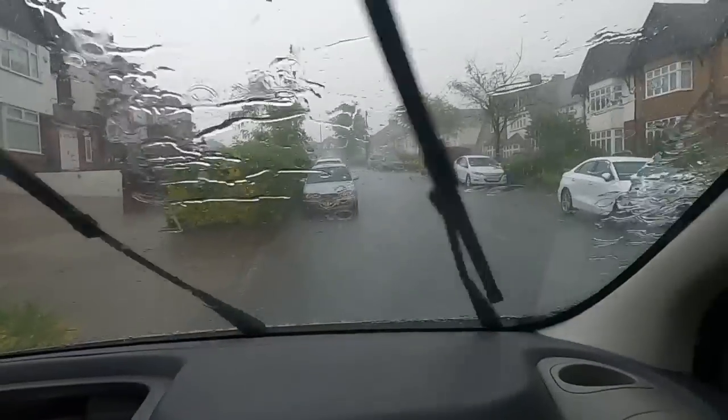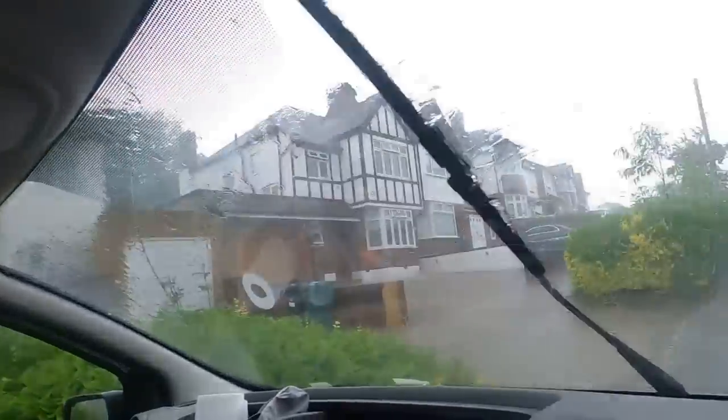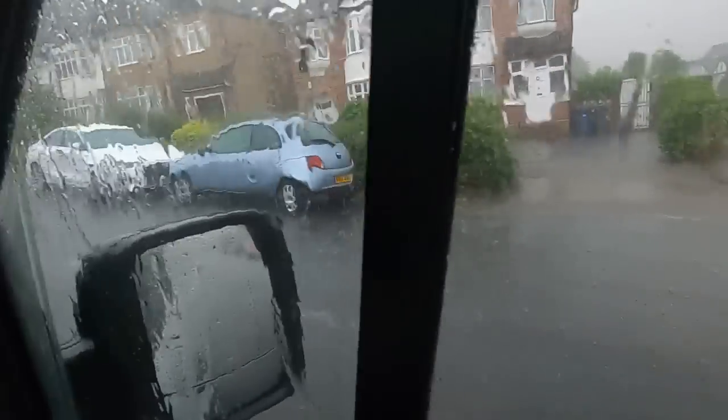I'm going home now. I've had enough. It's going to rain, I'm sure. I've had to pull over. Right, this garage — I was told, before I got there, that it was just off a slab, not a strip foundation, and that it was square. Well, it's neither of those. Because what I was going to do is show the young lads how to set a square out with tape on the slab. But we won't be doing that because it's not square.